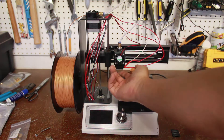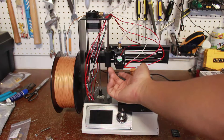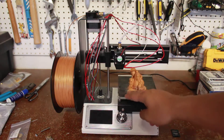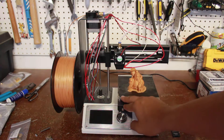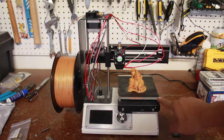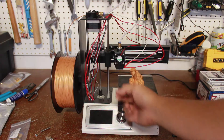After replacing the extruder head, I realized it was sticking out way too long because the replacement wasn't exactly the same size as the original. What happened was the extruder head would hit my build plate, and even adjusting the build plate by screwing or unscrewing the knobs wasn't enough for how much it was sticking out.